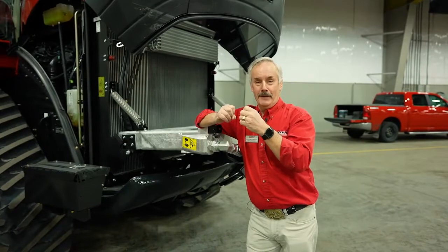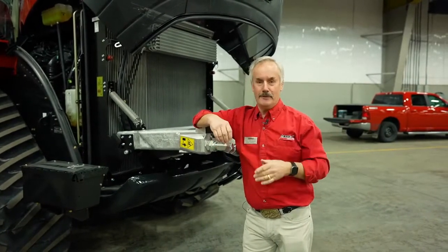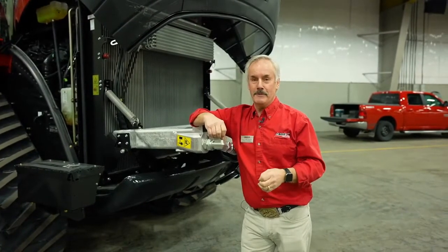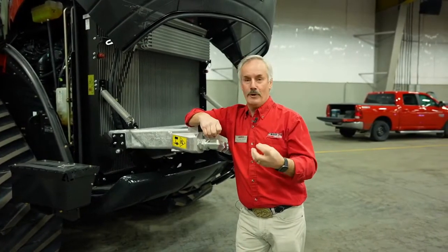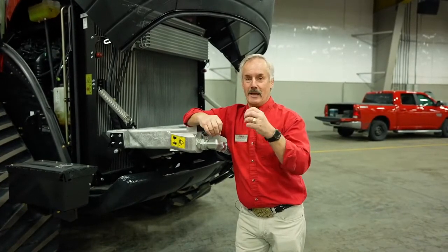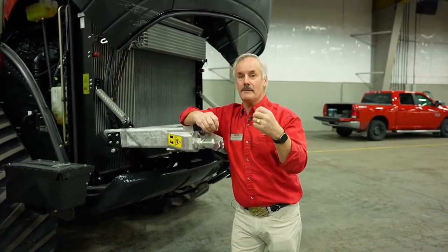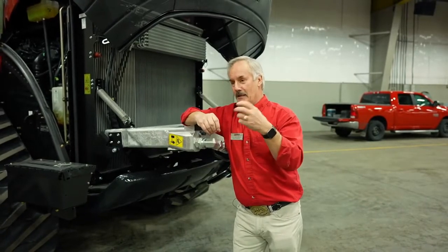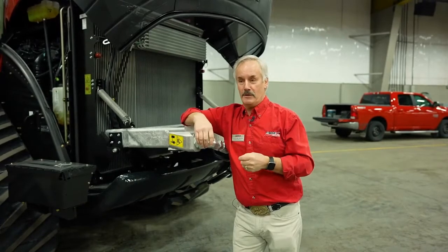I always use the reference, if you've got a boat on the water somewhere, and you see all the bubbles coming from the prop, those are not air bubbles. Those are just pockets of void. Same process happens inside here. So that cavitation eventually will eat the side of the sleeve, and it's more prominent on the compression side. It just keeps eating at it until finally, it pokes a hole right through the sleeve, and now you have antifreeze in the oil pan.